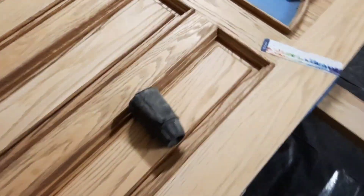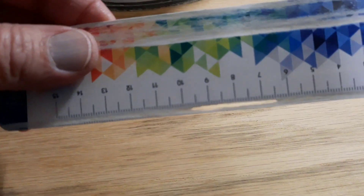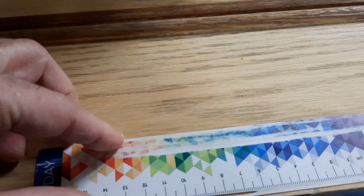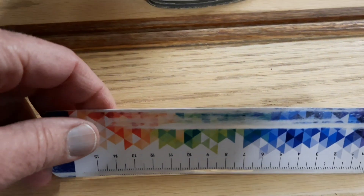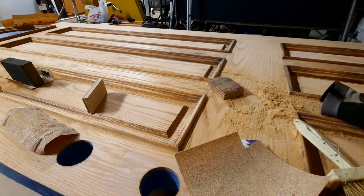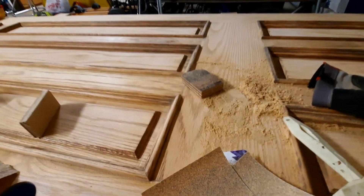I found this little plastic ruler that I've been using up against the side of the molding to prevent any grooves from being created. Along the top here there are a couple of areas where I got a little bit close to the molding — just make sure you protect those areas. I've spent about an hour just sanding the molding on this one panel and we've got five more panels to go. You might be able to see a change in the sawdust color coming out of these corners because it was really discolored from the sun and the polyurethane stain.